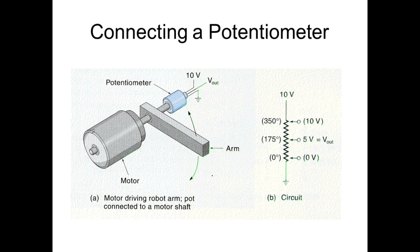And then what I'm going to do, there's a better way of doing it, because this will oscillate a lot. And this one we won't get into PID controller. But what I could do is this famous circuit that we call a comparator. Right, you understand? Is a comparator, I could come over here, and then I could use a pot over here to set a voltage. And then I could bring the pot out here, I could bring it up into the other input. And then this right here would be the guy that's actually running. This would be the switch that's actually running the motor.